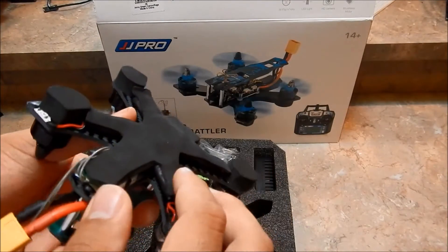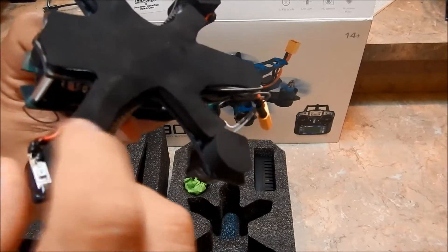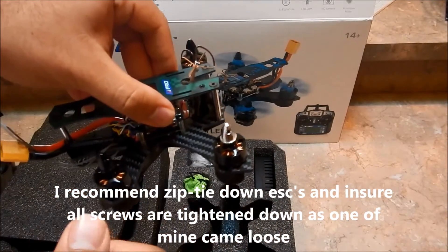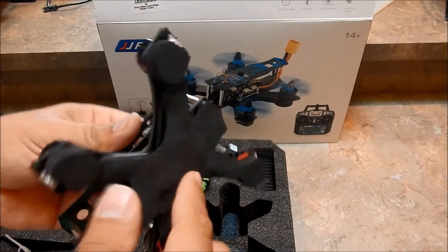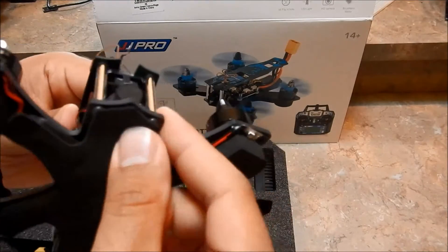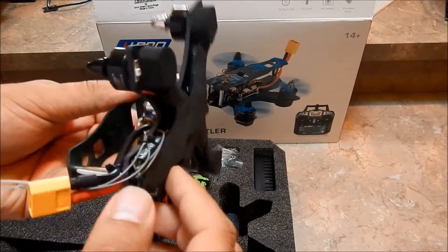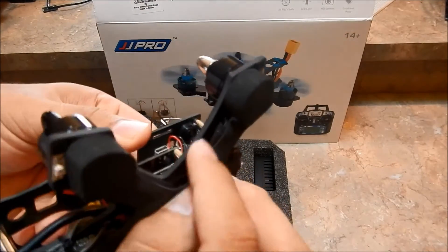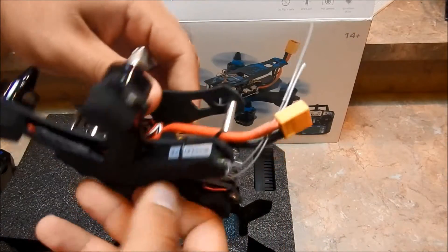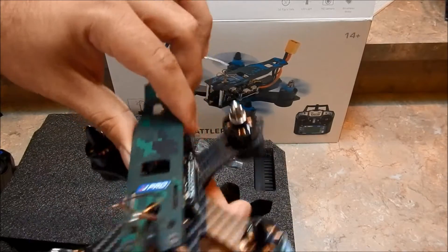You can see the Naze32 flight controller in there. On the bottom, the landing legs are foam — straightforward, and if you rip them off you can get stick-on replacements. The ESCs are mounted on the bottom rather than the top, which is likely for space purposes, with wiring held down by a foam double-sided adhesive. Not sure how long that material will last through many crashes — might want something more durable. The ESCs don't appear to be zip-tied down, so you'll probably want to add a couple of zip ties. The receiver is right underneath and looks like a pretty standard size.